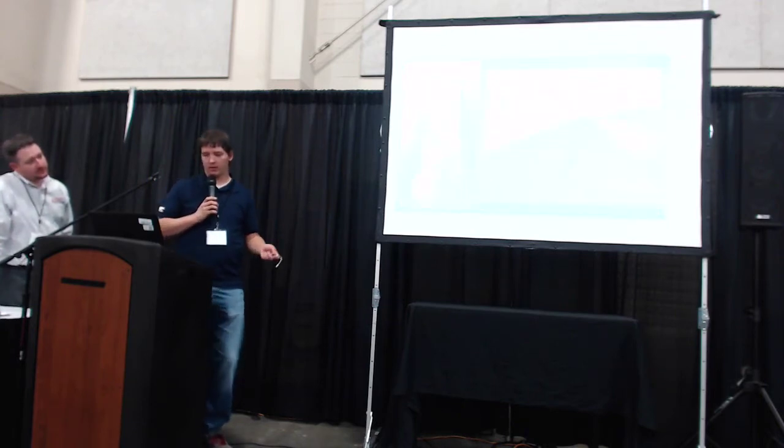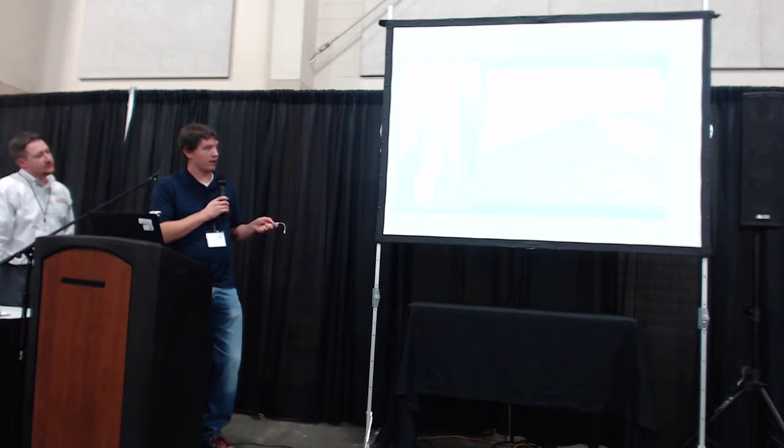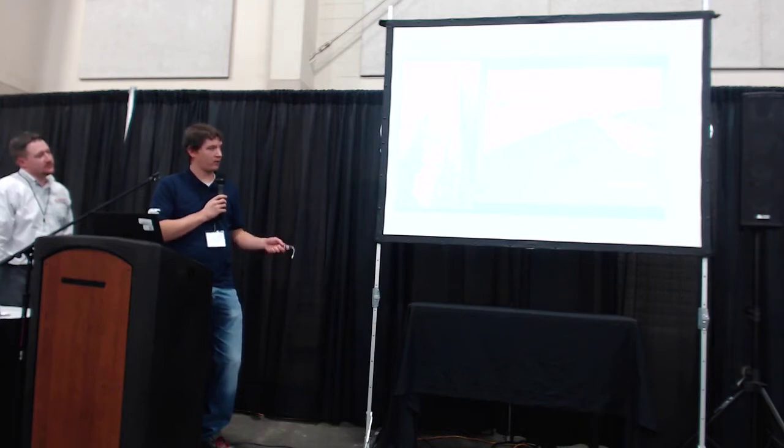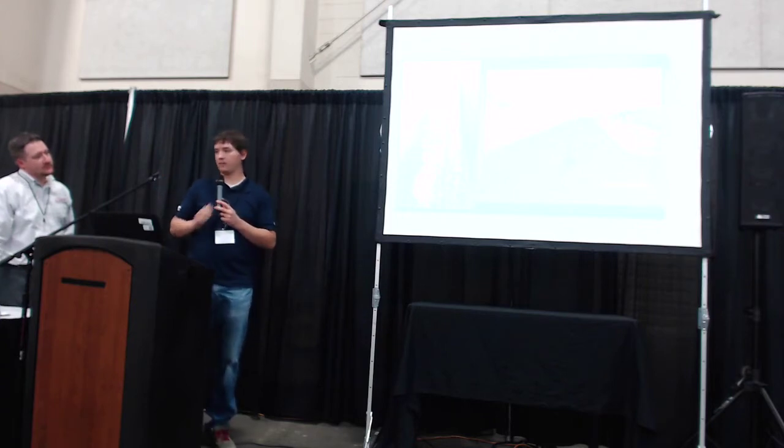Right there, this one's harder to see. You can kind of see that's about what that crack looked like, but it was all the way up in the center. This is the joint line, so it wasn't on a joint line. This is right in the center of the pavement mat. They actually paved this first. They had 2 confined edges. So I don't know what happened there to cause this, but that is still there today. They had passing results. There was no way we could reject that. We had to accept it with a big crack down the middle of the road. That was paved over the top of, and that's where we left it because the specifications didn't address anything that way.